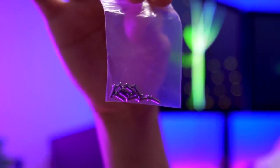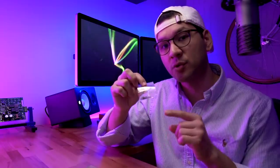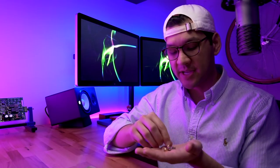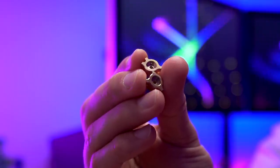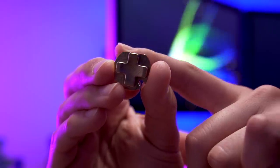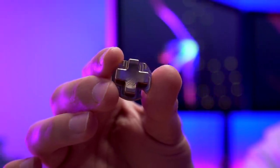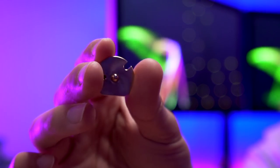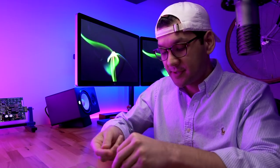As with all Boxy Pixel shells, they come with M2 machine screws that will replace all the original screws from the Game Boy Color — these are the only screws you'll need for this build. The next item is solid brass buttons. These things weigh a ton and the build quality is immaculate. On the D-pad there is a small cutoff to accommodate the IPS screen, since the IPS panel is significantly larger than the original. This cutoff helps make the fitment just perfect.